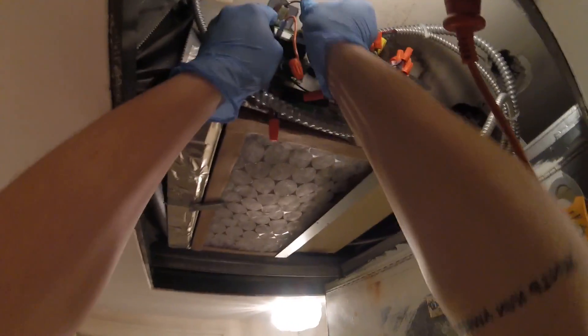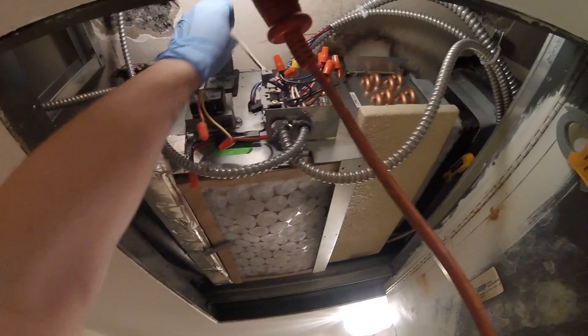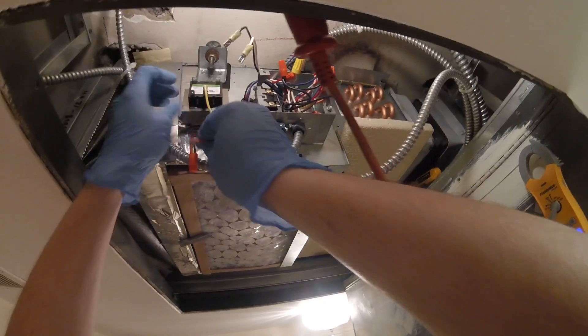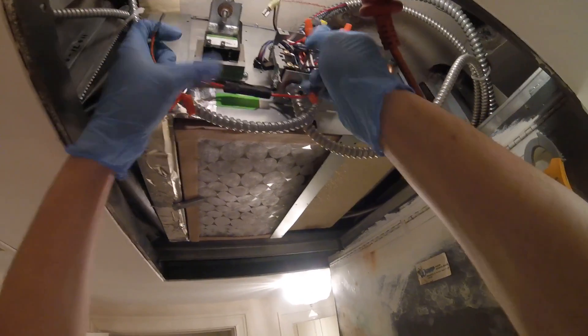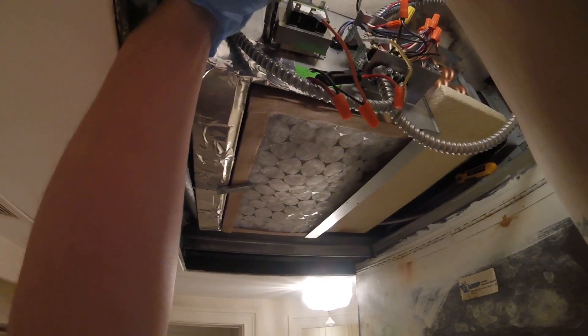Power is off. So that's my 120 — put it to the side. Here's my low voltage. The fuse was going into here just on the common side. You want to put this on the positive side, not the common neutral.